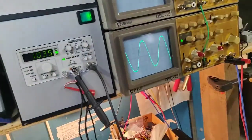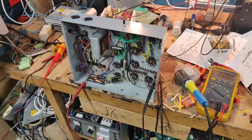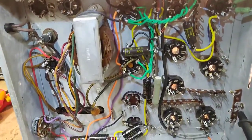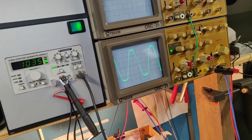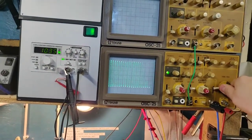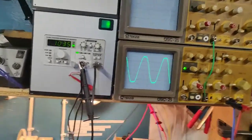This is probably because we installed all modern non-drifted resistors in this thing. We are using old school capacitors for coupling but new resistors, with the filter caps being brand new. You can see for yourself just how perfect this amp is. The reason it's jumping around slightly is because we've got a ground loop happening.